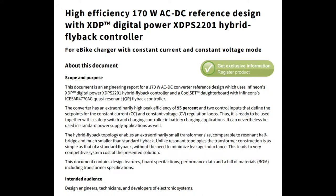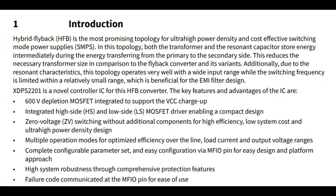You can drive it from 110 or 220 volts, depending on whether you're in Europe or North America. It can handle different output voltages as well, which could be handy as you're charging the battery — the voltage changes as the battery charges, or maybe you want to support different size battery packs with one PCB design. What's really nice is that the XDPS2201 chip has a lot of stuff built in: MOSFET drivers, and a mini bootstrapper that helps you drive both the high side and low side MOSFETs without needing a separate driver chip.